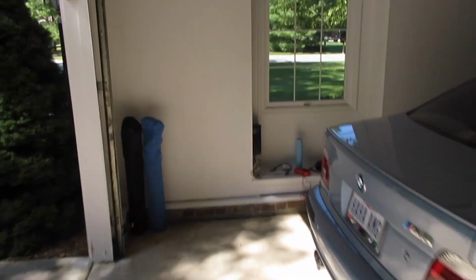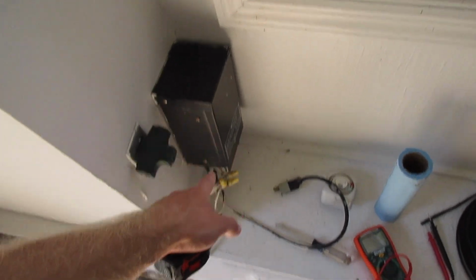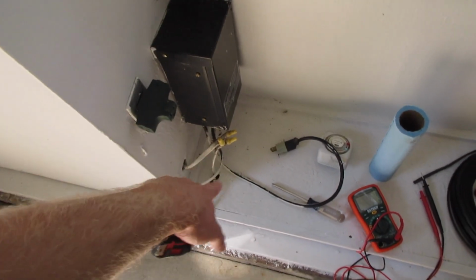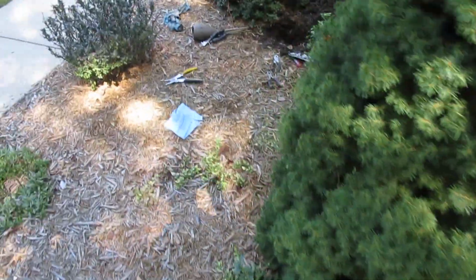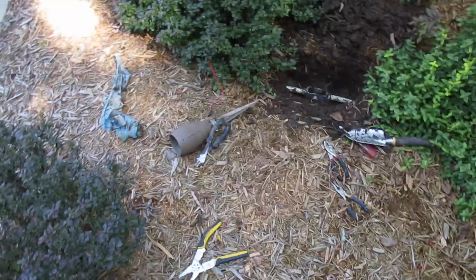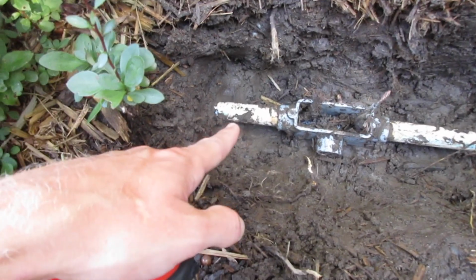So today's project is Project Landscape Lighting. The transformer is here. There's a hole there that goes into a 1-inch PVC pipe. We go down about a foot and then over to the first landscaping light. And there's a junction box here. You can see the pipe coming in, the pipe going to the next light. There's a total of 5.